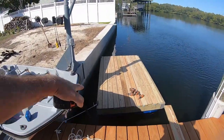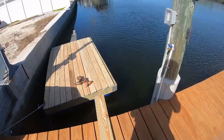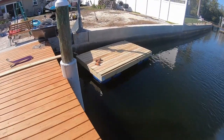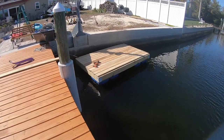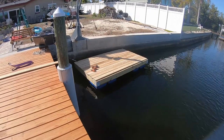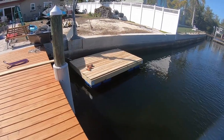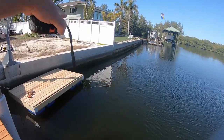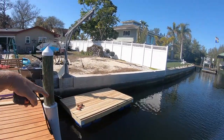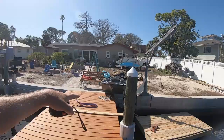And I put the cleats on, and you're seeing that the dock is setting above the water line, which is great with nobody on it. It means that the wood won't be soaked in water. And these are 30-gallon, not 55-gallon drums, which is fine also. And you see that it's about 12 inches off the water, which is ideal for kayaking. So I'm going to mount that probably over there someplace to keep this area here okay for maybe a jet ski or a small boat or something like my little boat here. And then I'll put the big boat up there and here.